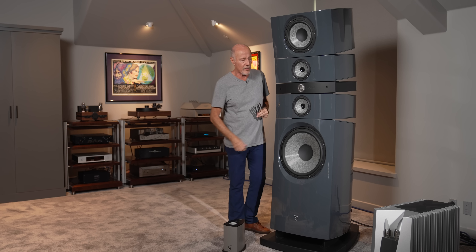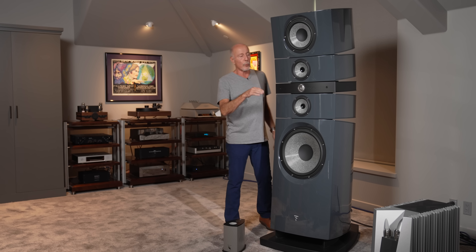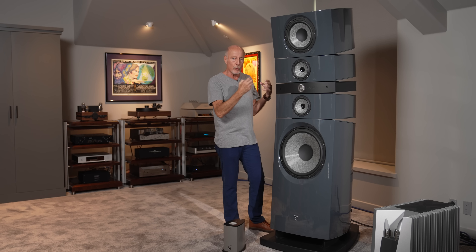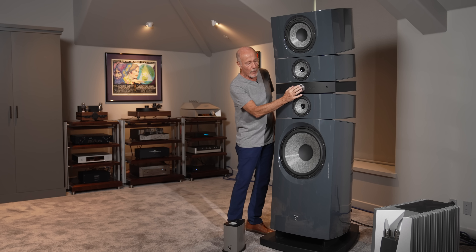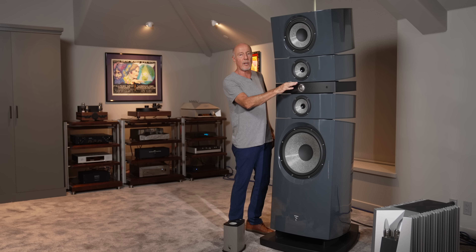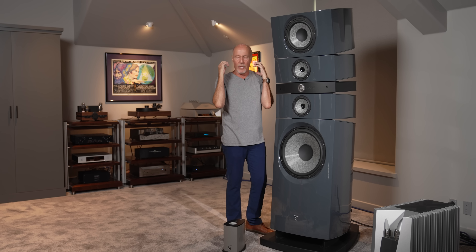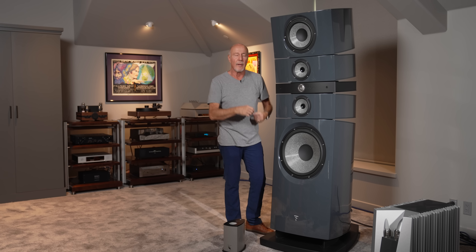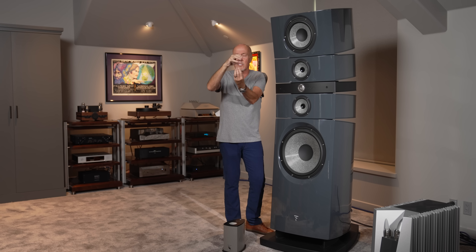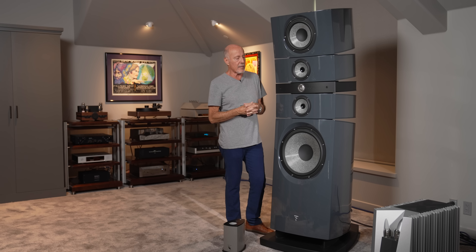They have also created a new design called infinite acoustic loading. What that's about is lowering the resonant frequency of this high-frequency driver by controlling the amount of back pressure to the back as well as to the front. That is a really big deal because the suspension for this high-frequency driver is such that it does have some excursion to it. What they're trying to do is cross this thing over lower and lower so it can meet the mid-range drivers, and then your brain's going to be less confused. The whole thing about speakers and mid-range is making sure you don't distinguish the tweeter from the mid-range — you want to try to create a single point source if you can.